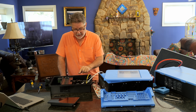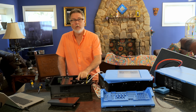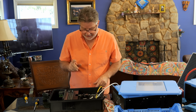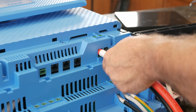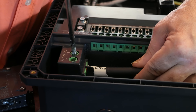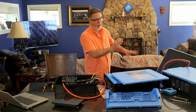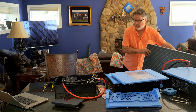Okay, I have the panel wired up. I'm using a 20 amp breaker because it's just what I had lying around the house. If you're going to be using all four outlets you'll want a 40 amp breaker for the main. You come in on the center for the main and the ones on the outside are where you run your appliances — with your neutral bus bar and ground bus bar. Now I'm going to connect the solar panels — I already connected them in parallel. You can do series or parallel; I'm not going to do a full video on that, but suffice it to say I have these done in parallel, and I'm going to run the wires over to the e-panel.